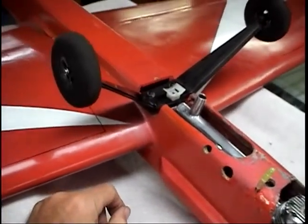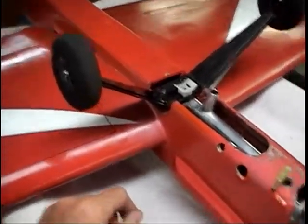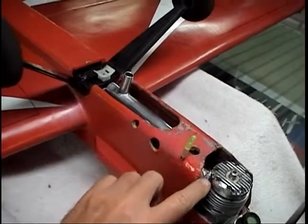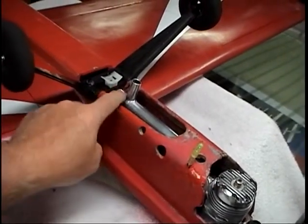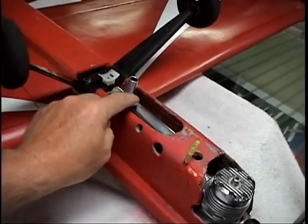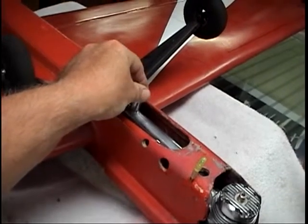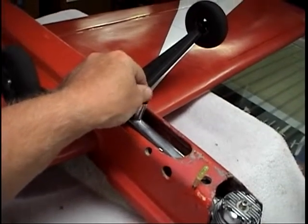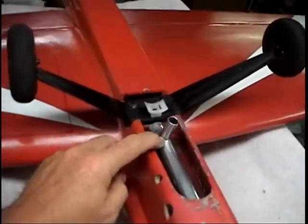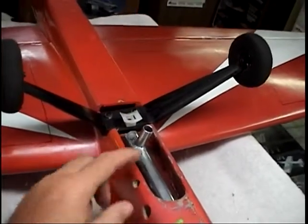And I was just toying with the idea, I guess, that I wanted to finalize, I hope, this header design. Now this is 49 grams with the weld joint and with the back. I used the lathe to make a back cap, soldered this. In the past, when I've soldered this material, 90% of the time it holds, but the one time it doesn't. And the good news is, nothing bad is going to happen if that joint breaks, or if the back comes out, it'll just get loud.